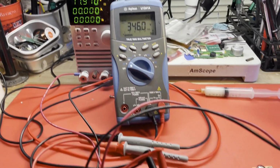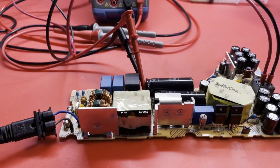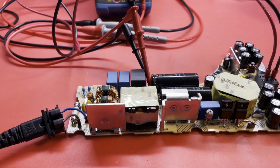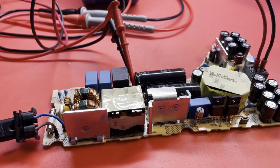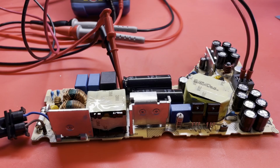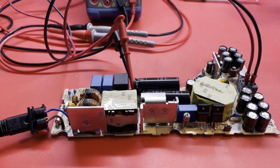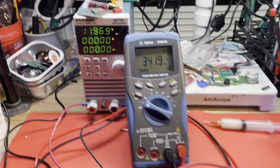Okay. Which, on this design, on previous designs on the PS4s, you had an IC that just did power factor correction, and then you had one that handled the generation of the 12 volts. Well, on this one, the ADP-400FR IC on the back does it all. So it's a power factor corrector and the DC-DC controller. So that's a good possibility. Those chips do die. Could still be something, I suppose, in the feedback circuit. I do find it odd, though, that it doesn't shut down.